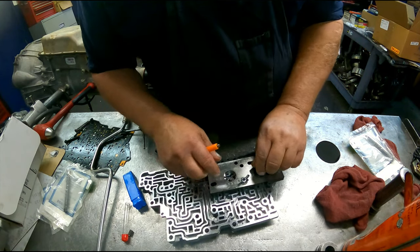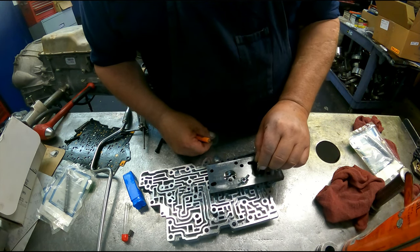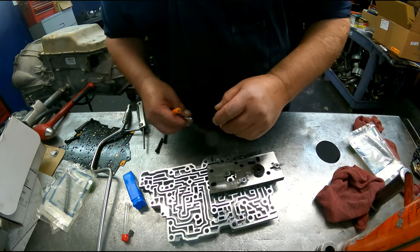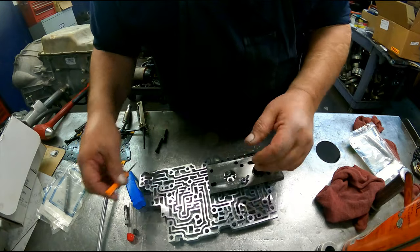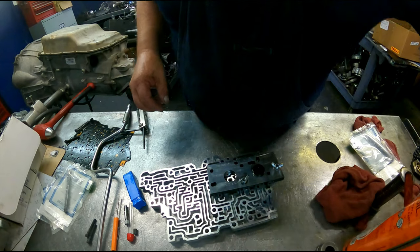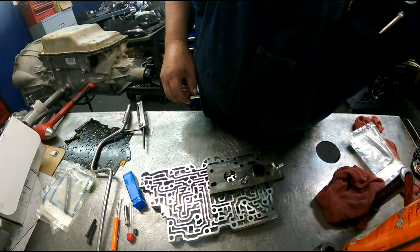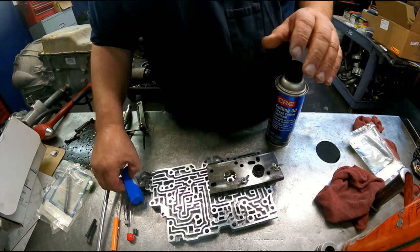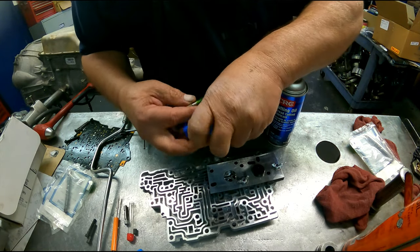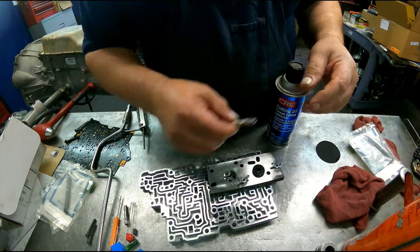Put the pin in here, tighten these down, and make sure that once you get those tightened down, this pin will float in and out super easy. I may need to bring this out to the end of the table and tighten it down and hold it to the table. We'll see how it goes. Get some cutting oil. With the inner reamer, you're going to want to only turn it clockwise — never turn it counterclockwise. Use plenty of lube.